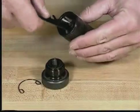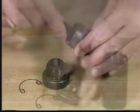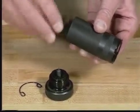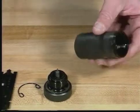Using the cleaning tool inserted into the piercer pin guide as shown, clean the piercer pin guide and surrounding surface. Insert the cleaning tool into the breech cap sleeve and clean the recesses of any plastic or carbon deposits. Rotate the tool several times to assure proper cleaning.